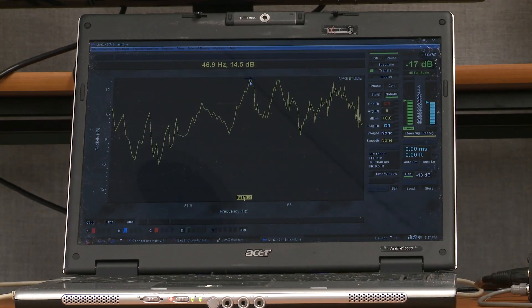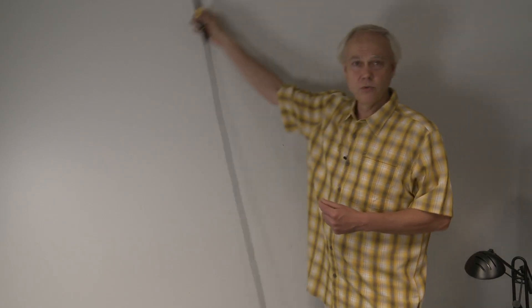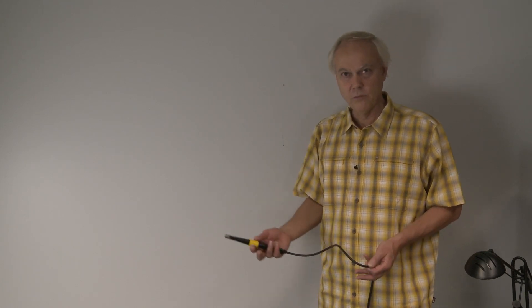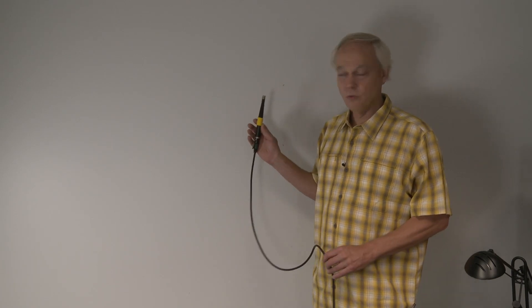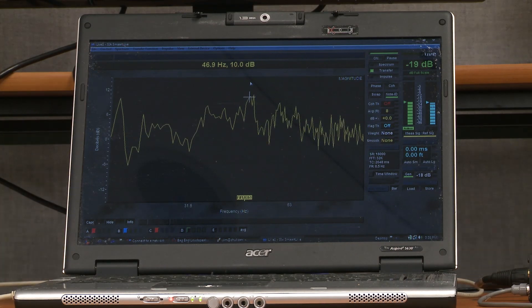I'm going to move the microphone and bring it over to the boundary along the wall where the pressure is high at the particular mode of interest. Where the pressure is high, we can identify the frequency of the mode anywhere on this wall — all the way down to the floor, to the left, to the right — and when I go to the opposite wall we'll see the same frequency. This is how you verify that you've identified that mode and that you have pressure, because you can't absorb a null — you have to absorb where there's pressure. You can also verify the mode by going to the middle of the room, where you should see the energy disappear into a null. That's a good way to get to know the room, and once you've learned what the room is doing you're better equipped to tune an E-Trap.